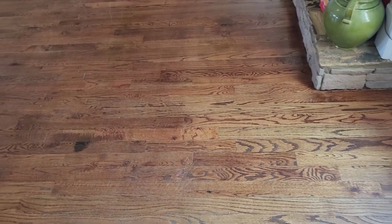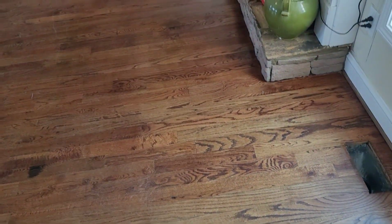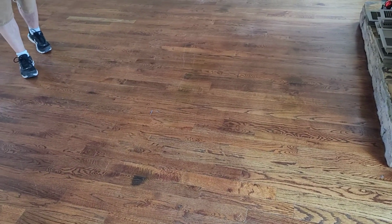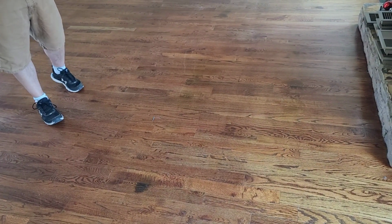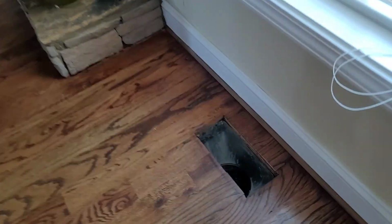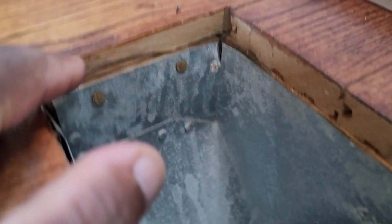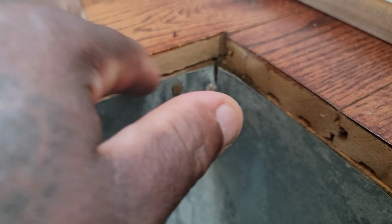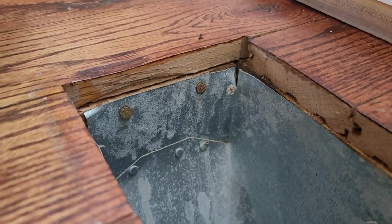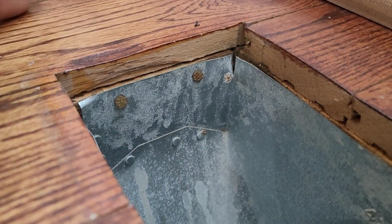What I was just showing Furman, guys, a good way to see if your hardwood floors are solid or engineered. Remember I told you that 9 out of 10, if it's on a slab, it's probably engineered. Well, this is a slab because they have no basement, but it's solid floors. If you take off the air vents, you can see that is a solid piece of floor. There's no layers. You can actually see the stain going into the wood. So this is a solid hardwood floor, which means this floor can probably be sanded 4 or 5 times.